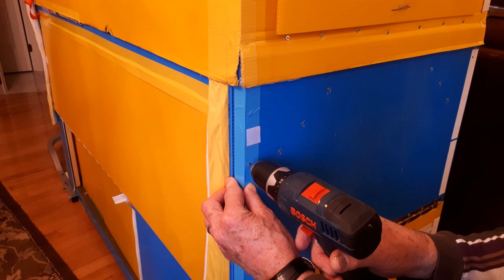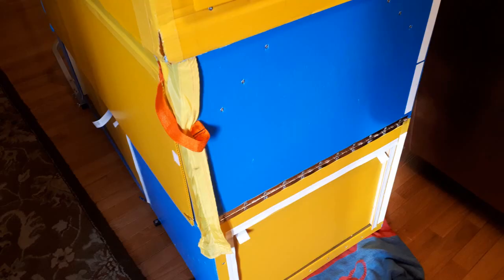I needed to find a way of holding the rear wall and the side walls together. At first I installed screen door hooks on the inside — it was awkward to clip them closed and they didn't hold the walls very firmly. So eventually I thought of securing pins like those at the front. Here I'm drilling a hole through the studs of the rear and left side wall. The pin serves to hold the side wall steady, preventing it from moving in or out.